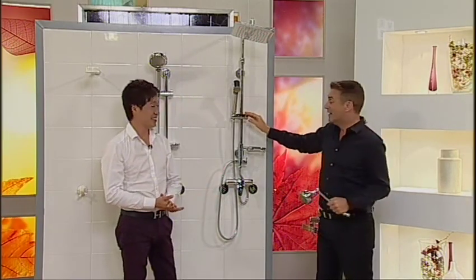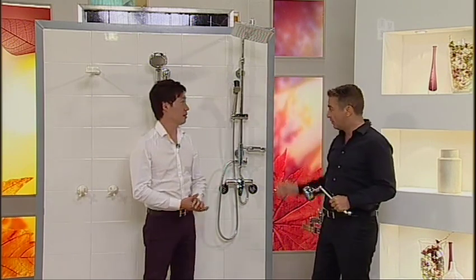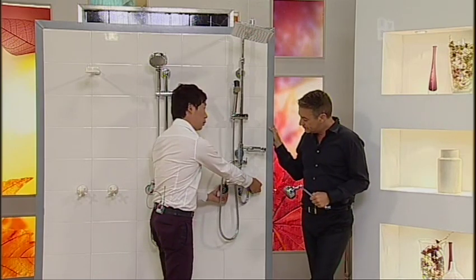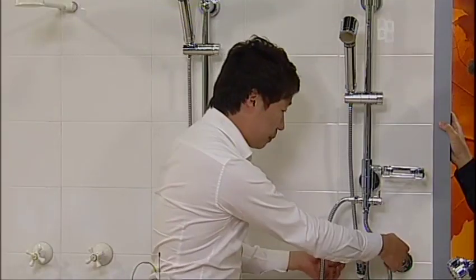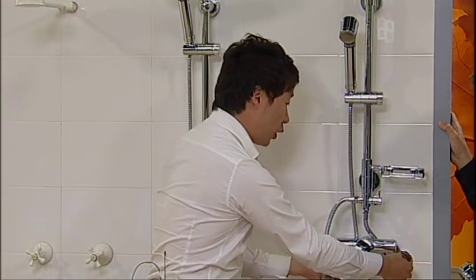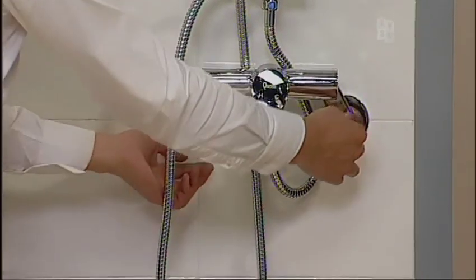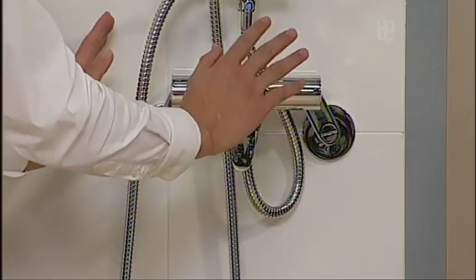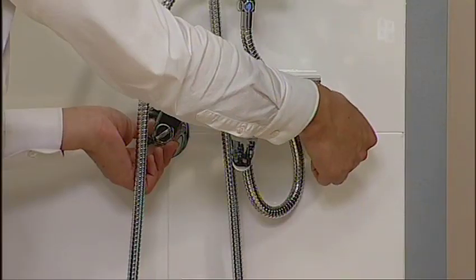Best of all worlds. All of it can work in conjunction. Do you want to explain the dual and how it's actually installed? Like this mixer with our patent fitting, it can go into any dual tap system, whether it's vertical or horizontal, and it doesn't matter what the distances are as well. So without any construction, no plumbing work, it will just retrofit straight into your existing plumbing system. Once that's installed, the rail is itself height-adjustable. If you've got a shower hose about this high — whether that's high or that low — it doesn't matter, because you can adjust the bracket but still move the rail up.